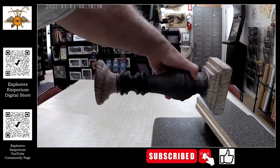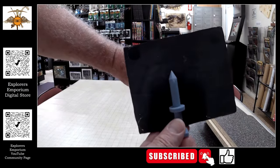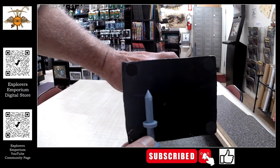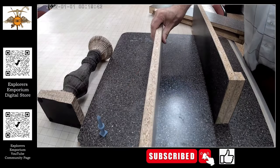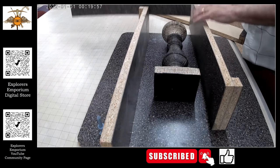These pins, when we make them, they have to be a little taller than halfway, so that when we go to pour the mold, we'll be wanting the little tips of them — the points — to be just above the poured silicone mold line.